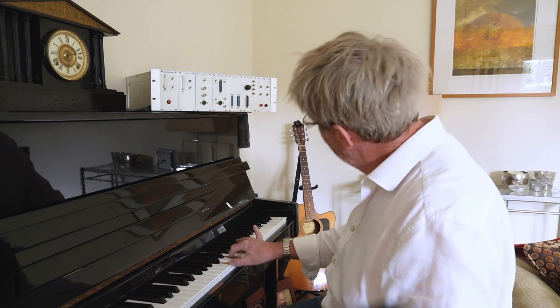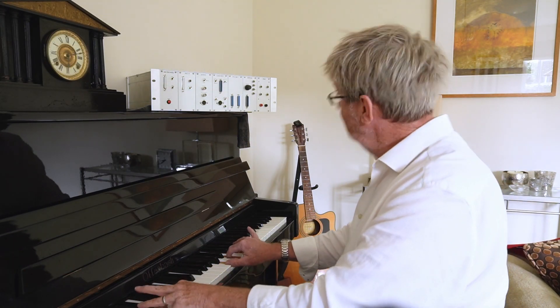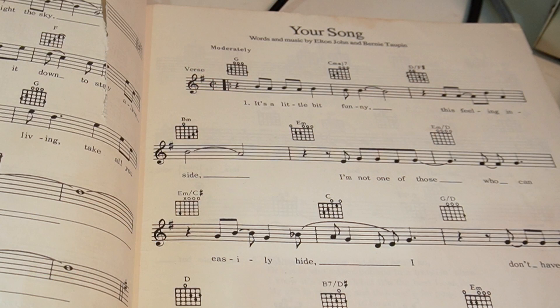It turns out there's a bit more to it. After some head scratching and some bedtime reading, I realised that the data being sent to the sound module had to be sent in real time — in other words, one note at a time, exactly as it would have been played. It's obvious really, I suppose. What it means is that for this to work the NASCOM has to play the music properly, just as it was written, the timing and everything.